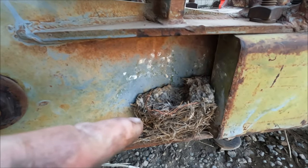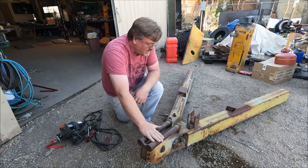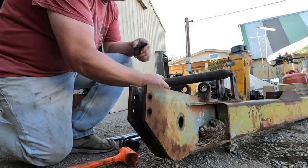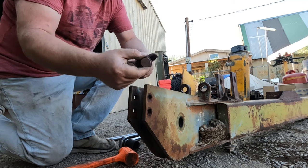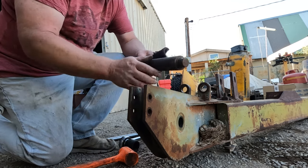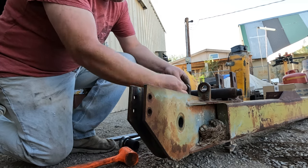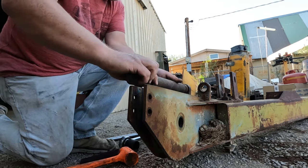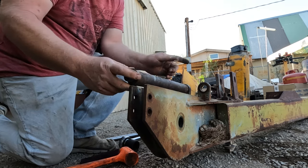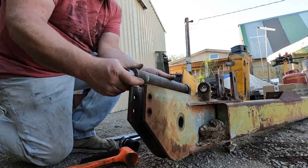There's the bird's nest. Also, the rollers don't roll anymore, so I've got to get this thing working again before I can permanently attach it. I got it apart and luckily it's nice plain bearings — just bronze bushings with solid steel on the end. Pretty corroded, but it'll clean up easy. I hit one with a wire brush already, and I'm hitting these with a little scotch brite. It's taking off the old grease and remaining rust pretty well. Now they rotate, and I'll pile a lot of grease in there. That should be good.